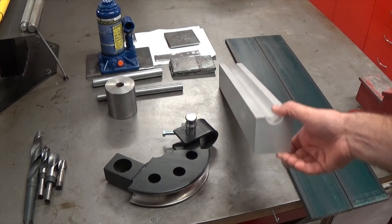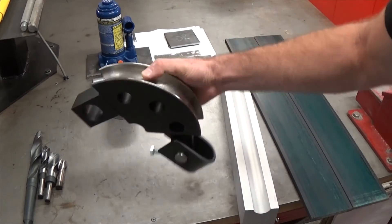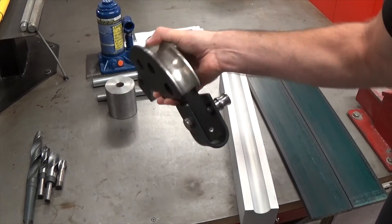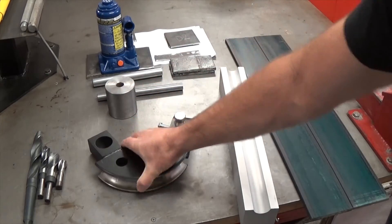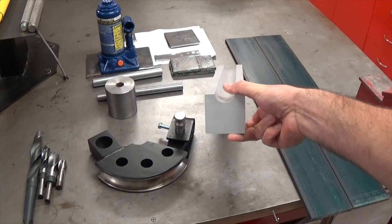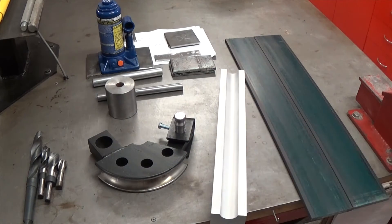Generally these are pretty hard to make at home successfully. If you want to make something that's repeatable, these will be all CNC machined and then these big blocks are all welded on and it's probably heat treated as well. The wiper or follower die is a big massive chunk of aluminium that's been machined out. These are specific to one and three quarter inch and they're hideously expensive to ship from the US where they generally come from. So I happened to pick up a second hand set on eBay at a reasonable price, so I thought right, it's time to start a build.